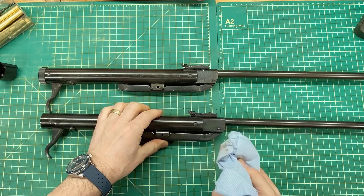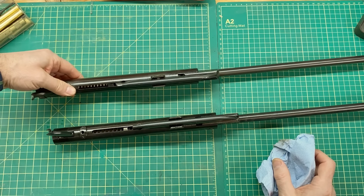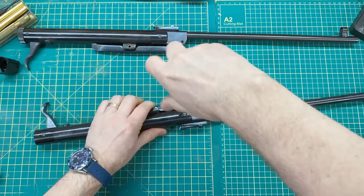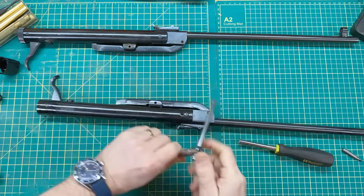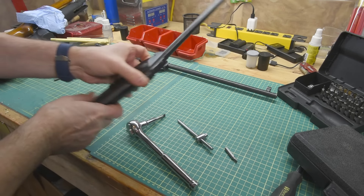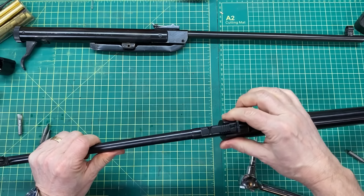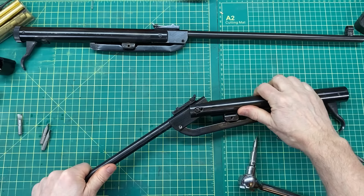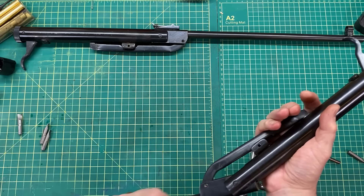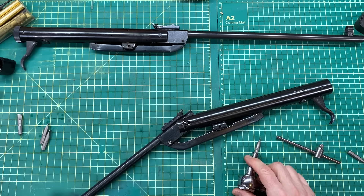This newer gun needs a good thorough cleaning. So you might see some refinements here — let's pull it apart further. Well, this is interesting and unexpected. This screw right here, which provides access for the barrel and a bit of clamping force to keep the barrel snug in its forks, only backs off about half a turn and then comes to a complete stop. At some point this thing has been damaged or peened in its assembly at the factory, making it coming apart almost impossible.